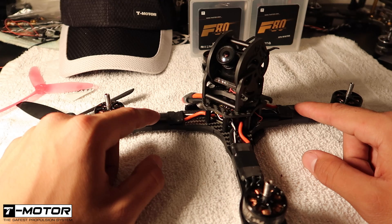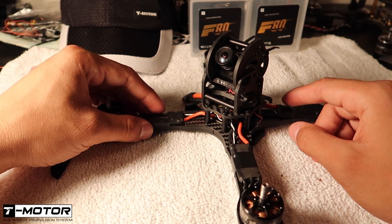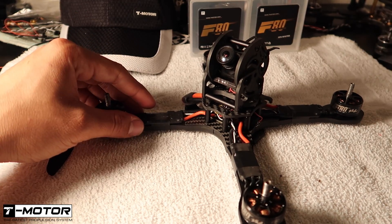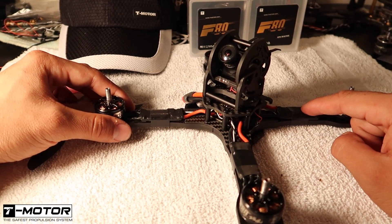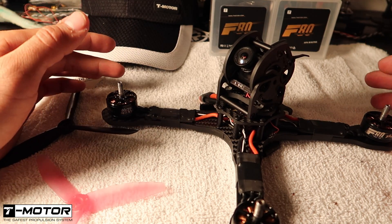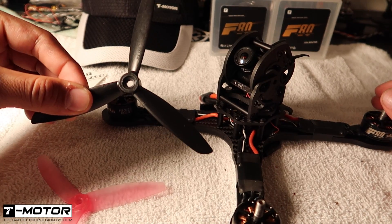Now for the ESCs: I ran these on DShot 600 — they already came pre-flashed with DShot, so all you had to do was select it. I'm pretty pleased with these ESCs; they held up on 4S, 5S, and 6S just fine. After every battery I would touch the motor and ESC temperature — they were not even warm. If you're planning on running this motor, I'd highly suggest a 45 amp ESC. Not only are these ESCs designed specifically for these motors, but they are rated 45 amp continuous and 60 amp at burst rate — more than enough protection if you decide to run them on 5S and 6S with a 6 inch tri-blade.